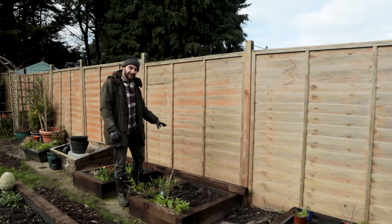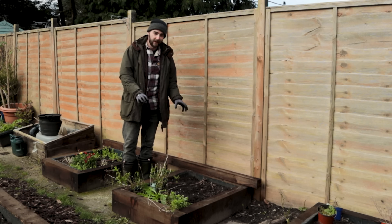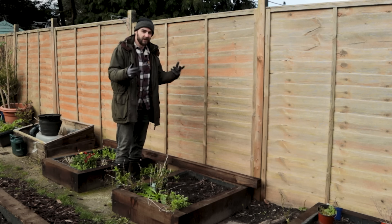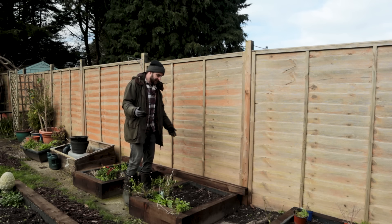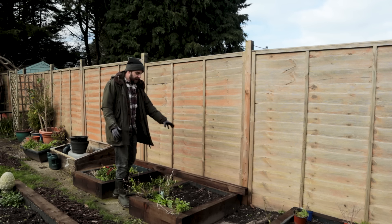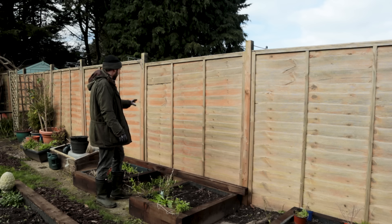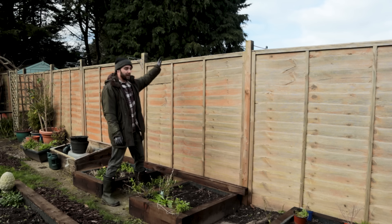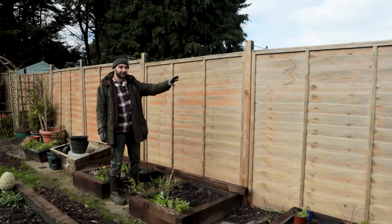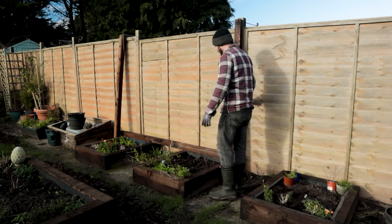The design itself couldn't really be much simpler. I'm going to have two uprights and then two cross beams — one at the top and one further down just to strengthen it. These are going to be tied into the little planters at the base. If you didn't have those, you'd probably want to put them in the ground — either dig them straight in, though they'll rot quicker, or use ground spikes or postcrete or whatever suits. I'm going to cut these to size. This is a 2.4 meter length and we only want to come up to about 1.8 meters, which is around the height of sweet peas — maybe 1.9 or 2.0, just whatever fits.